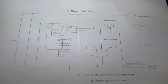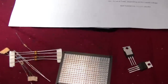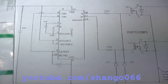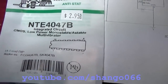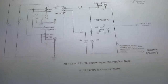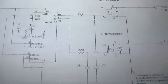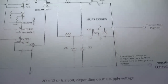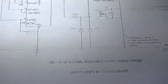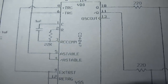This is our solid state vibrator replacement, and I'm really dying to see how this works. We've got two FETs and a 4047 IC. Off pin 10 and 11 you have two 220 ohm resistors that go to the gates, then two Zener diodes to ground - the Zener diodes are 6.2 volts or 12 volts.